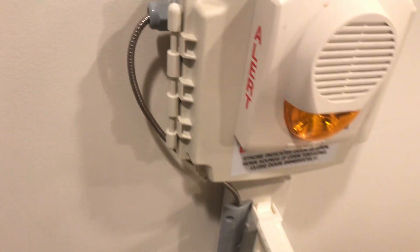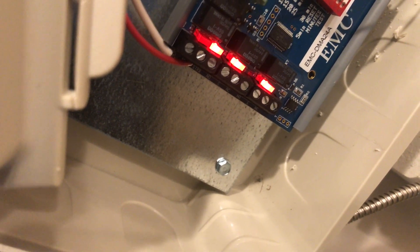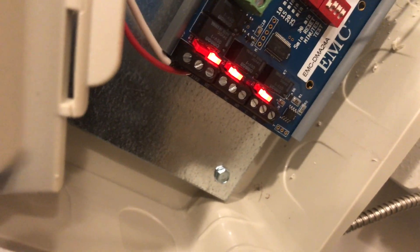To reset it you just close the gate. Inside there are little LEDs. I'm going to open the gate and you'll see the LEDs as different stages happen. The first LED you'll see immediately come on will be the strobe — the magnet's gone, so that opens the relays and turns on the strobe. Then we wait for the counter, and then you'll see the fourth LED come on, which means the horn is turned on.